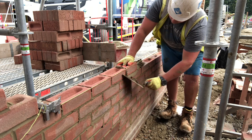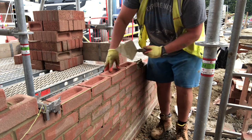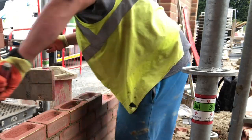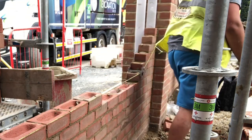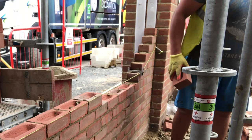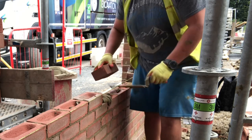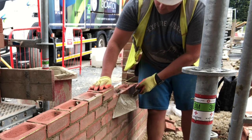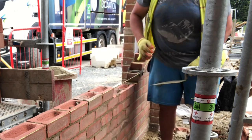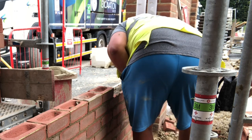No pillars in this one because I'd already built the pillar expansion joints each side. I've got a little modified technique for the smiley line method with the fits brick. I still set it up for a smiley line, but when I'm pulling the tension on the fits brick I don't pull it fully tight — just tensioned. Then I move my line up, which slacks it a bit. This means I only have to adjust the line every two bricks, so I can get two movements out of the fits brick clamp — do two courses without having to tighten it, then tighten every two courses.